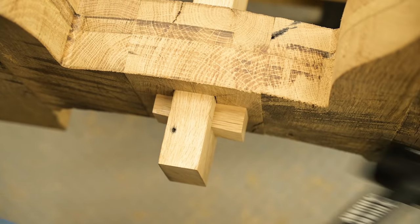So this is gonna be the bottom. If I was able to control it, I was gonna skip plane both sides, but since I wasn't and we just chewed through it all and we have to leave that, this is gonna become the bottom and we'll glue it up this way after we rip all the sides and get it all jointed well. And then for the top, we're just going to sand it. It's just gonna take a while, but sand it down to the level we want.